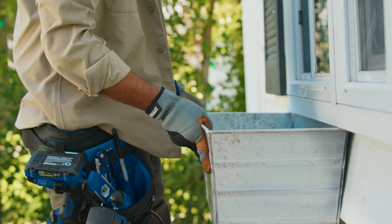I've marked the ends of both of my wall boxes and now I have to take the measurement of each window box, divide that in half, and then each half divide that in half. That's where I will install the included two wall brackets so we can have even distribution. Now I have my two marks of where my brackets are supposed to go.